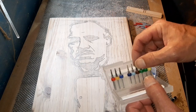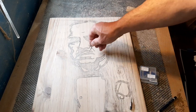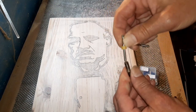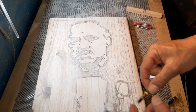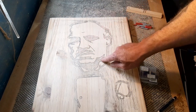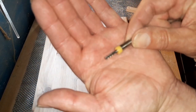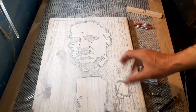Pick one that's a nice size and will fit in the smaller areas. Same kind of shaft — 3.175 millimeter — so you swap it over, push it up to your little barrier, pop it in, and set it to the same depth. Then we'll start clearing out all these areas. I've been known to do projects this size with just that one little bit for clearing out — it's a slow process, so we'll see how we go.